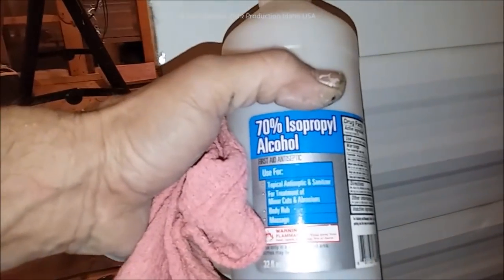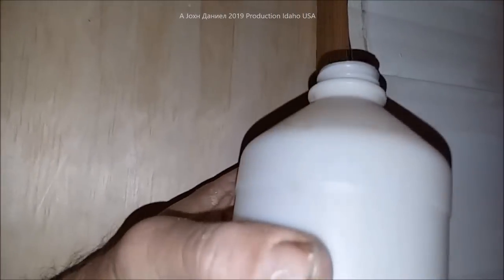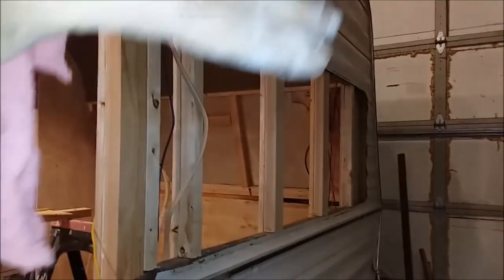After cleaning everything up and covering any holes that need patching, take some regular 70% rubbing alcohol on a rag and wipe the back side of this piece — that's your overlap — then wipe the top and the outside down, and try to reach in to wipe the back of that as well. Don't destroy your staples. Let the Dynaflex adhere to it. This aluminum has already been cleaned; I put it through my steam cleaner.